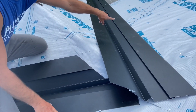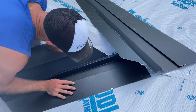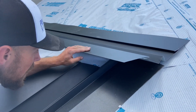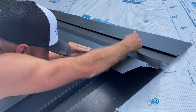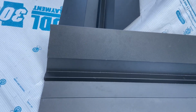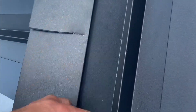You can attach this side pretty far up, but I only attach it about halfway up on this side so you can lift the pan up and slide this pan underneath until you're directly underneath the pan on this side. Then slide it across and mark right where the two points meet. At that point you can cut in to your point here, cut this off, and cut down the top of the W to here — and the top of the W to here.